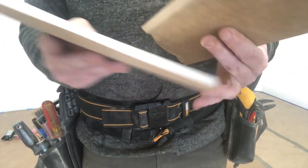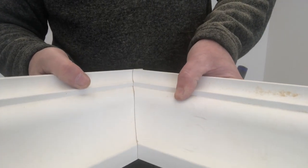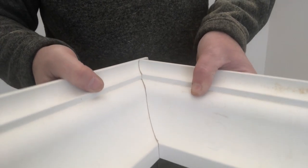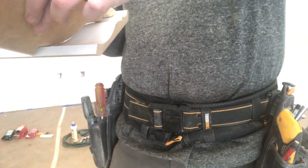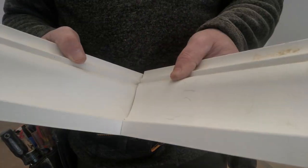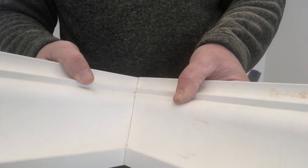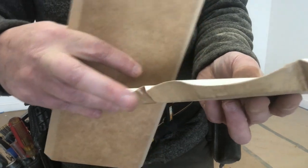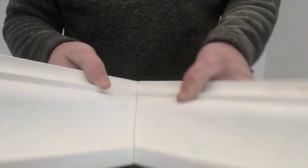It would help if I turned it right side up, or in the correct orientation. So you wind up getting a nice tight fit. And you see on the back side we've got the back end — the tail, the butt joint — protruding through. Which means if the wall angle is not exactly 90 degrees, this piece will rotate to some degree. This coped area, when it fits into this groove — the matching grooves in the crown — it locks it, so it's very, very tight.